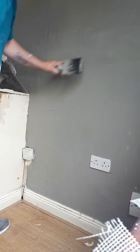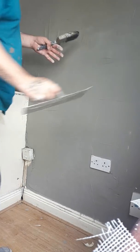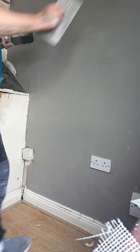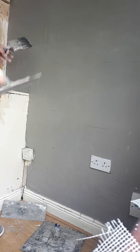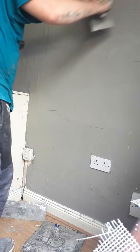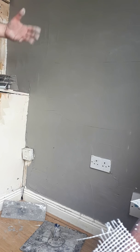So you'll just make sure you damp the whole wall with a drop of water, and then again wait another few minutes. Although if you're a beginner and a bit slow, which is no harm, it'll probably be ready by the time you get back to the top, which is why I suggest you do a small wall first. If you do a big wall, you could get caught out, and you get used to it. And then each time you come back, you'll get a little bit more of the lines out, you'll get a little bit flatter. And eventually it'll be very flat, it'll go hard, and you'll be able to give it a good polish, where you're holding your trowel at an angle and you're kind of polishing the plaster. We'll get to that in a few minutes. So for the time being, a drop of water over the whole area, and then give it a few minutes.